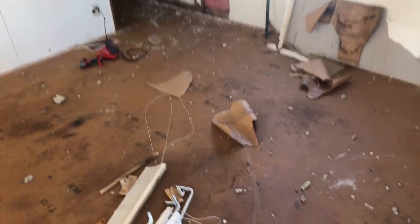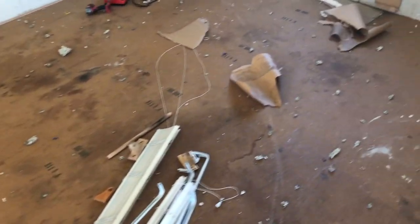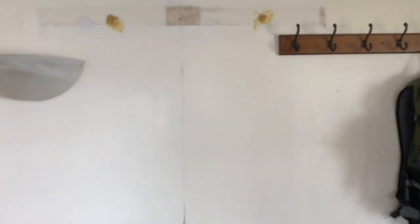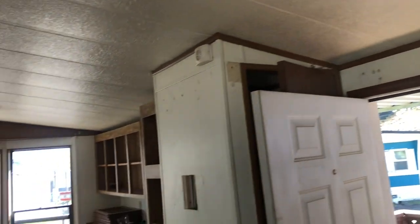On day one we've got all the carpet ripped out. Unfortunately the subfloor looks almost as bad as the carpet did, so after we take up all the staples and tack strips, we may need to put down some sort of stain blocker to get rid of any residual smell. This one room literally has hundreds of holes in the wall — it's like a small shotgun blast — so we're going to have to sand down and spackle all those holes before we do any painting.